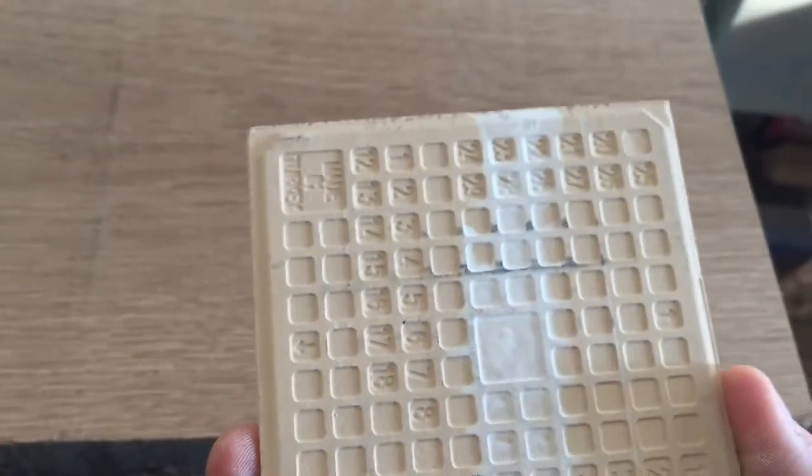Just a basic tile. What you want to do first to prep it is take some acetone, which I've already done, and wipe off any imperfections. Sometimes when they do the glazing process, they leave a little bit of junk on it, so by using the acetone, you clean it up really well. And then you apply a real thin coat of the Cermark. Just take it outside and it will dry great.